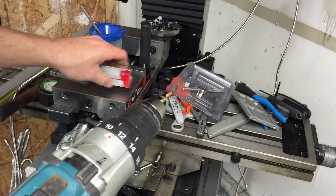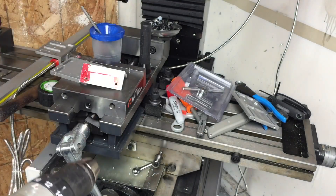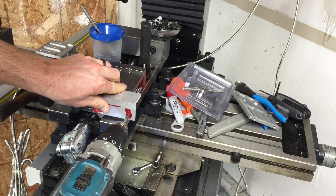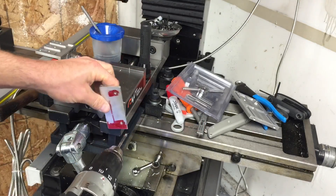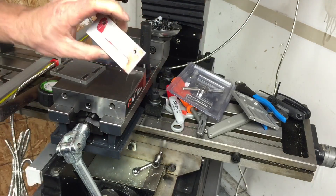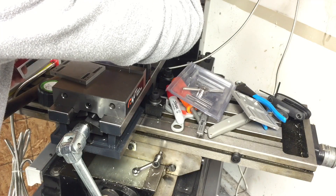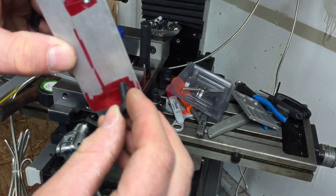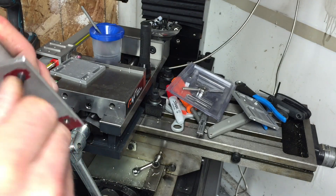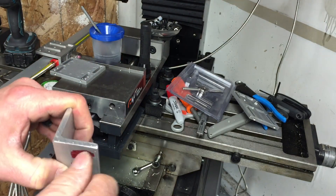I'm going up to the actual required hole dimension. Now I've got my tap drill. One hole done — two holes done. So we've got both holes drilled and tapped now. Testing the fastener in the threads — nice and smooth. For small size holes like this, all the way up to like five-sixteenths, maybe three-eighths of an inch, cordless drills are awesome. They save you a lot of time. One step closer to victory.